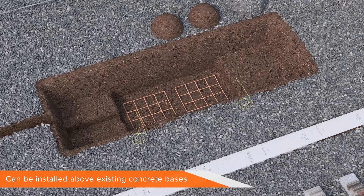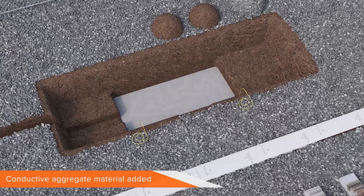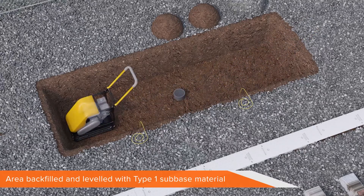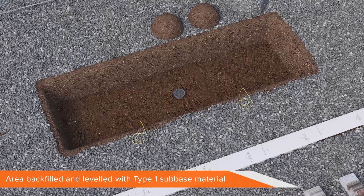When cabling up, the earth wires will fix to the points in the corners of the frames. Once installed, the earth mats are covered with a conductive aggregate material. Prior to backfilling, drainage pipes may be laid below where the chamber unit will sit. These are essential when mitigating against water ingress due to extreme weather events.